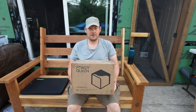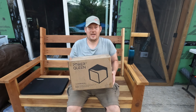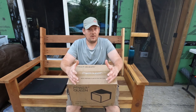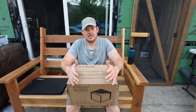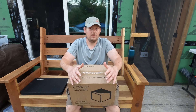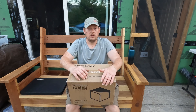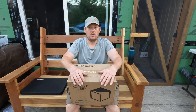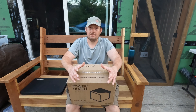One of the things I really like about the 100 amp hour battery is that it's not that heavy — this is a 22 pound battery, and a lot of people can move these around. They have up to over 400 amp hour batteries, so potentially four times this size, but that's also four times the weight. If you don't feel like lifting that much, going with a smaller battery and buying more of them connected together might cost a little more in the long run, but it might be easier for maintenance or just easier on your back.